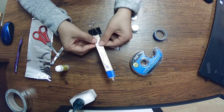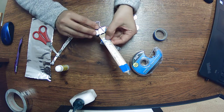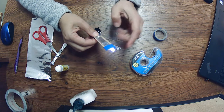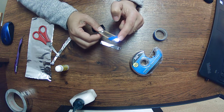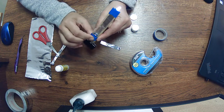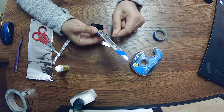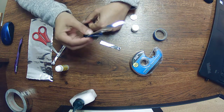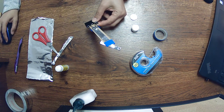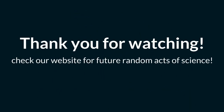We don't want any metal touching the other side. If we've done everything correctly, when I throw this switch and it touches the tinfoil it should light up our light — ta-da! Now if your light is not working, you might not have a good connection up here, or your battery might not be connected very well to both pieces of metal. Light off — light on! Nice, good switch. And there you go — popsicle stick light or flashlight. Enjoy your random act of science!